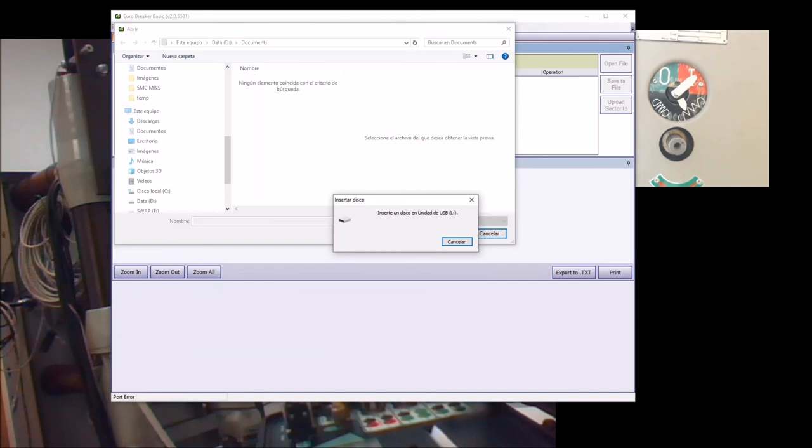Okay. And I think it's very important that you underline that thing about the Kelvin bridge or the four-wire method for contact resistance. Because, as you said, indeed, you need to have the lead that's doing the contact resistance measurement on the inside, as close as possible to the contact that you're measuring. Yes.